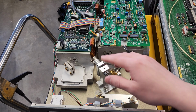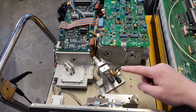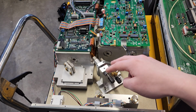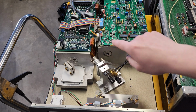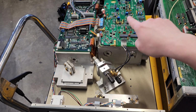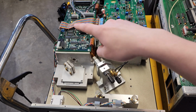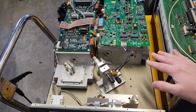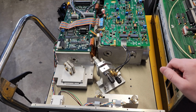Try tuning your mirrors this way, that way. And then it runs an algorithm, a feedback loop, to see if tuning the mirrors is increasing the power one way or another. And then it will sort of automatically optimize by tuning this mirror a little bit here. It's where the beam enters the resonator on this side, and that will help maintain the automatic alignment of this laser to this laser. And so that produces a very stable output intensity, which also helps maintain the stability of your amplifier.